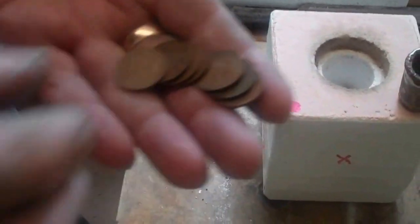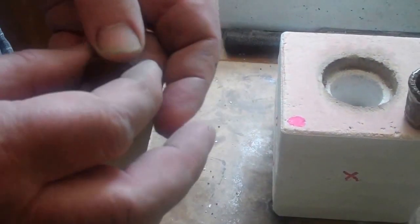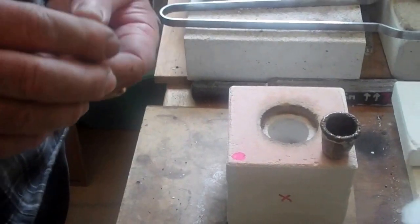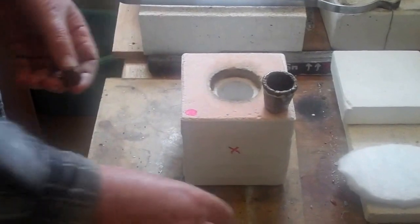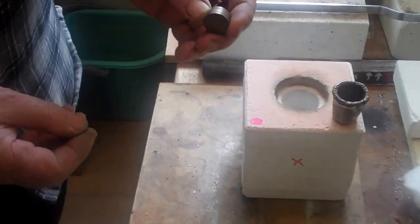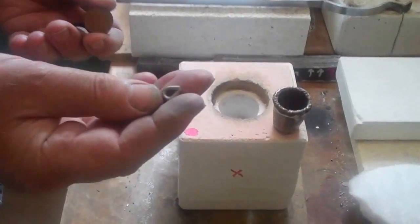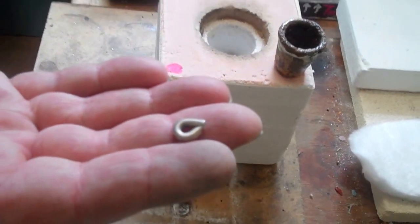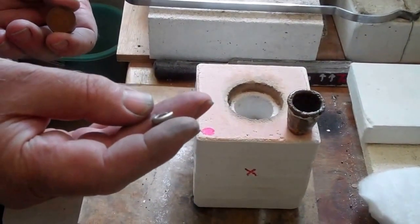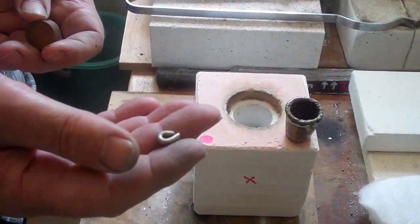We're going to use copper, and you'll recognize the copper — it's as copper as it comes. They're old pennies, which you can sort out with a fridge magnet: if they're not magnetic, they're copper. We're going to make up a 26-gram load — seven one-penny pieces and one and a half grams of lead-free solder, which is the cheapest type sold for plumbing. It's 99% tin, 1% copper.